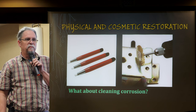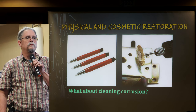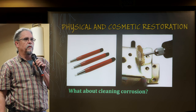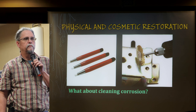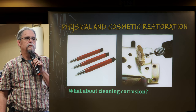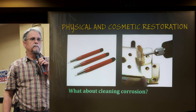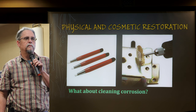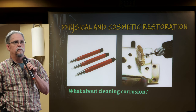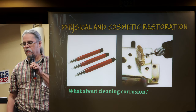On impulse I bought a totally rusted 24-inch bench plane for a buck and a half at the Kickapoo Trading Post in Wisconsin. It had been out in the snow and rain for 10 years and was severely rusted. I built a little box, dropped a big plastic bag inside, and filled it with vinegar from Costco — not very expensive. I soaked all the parts in the vinegar for about three days. The rust transformed into a black gooey substance that was easily wiped off, and the thing looked good as new — a $300 bench plane for a buck fifty plus the cost of some vinegar.